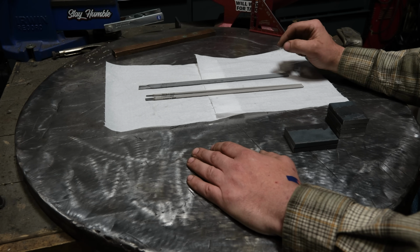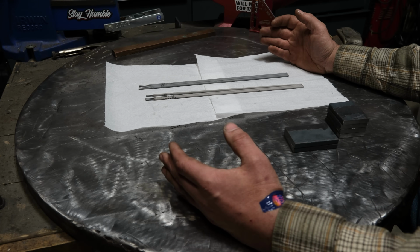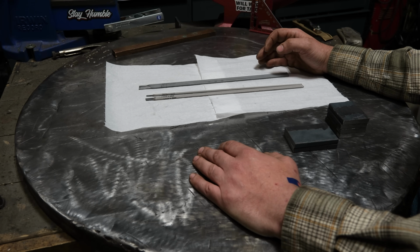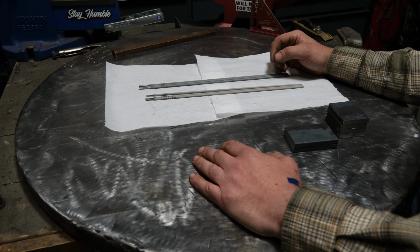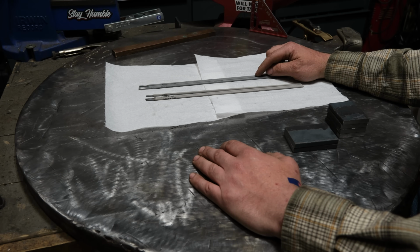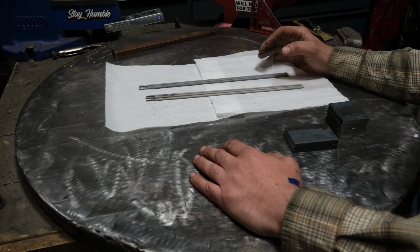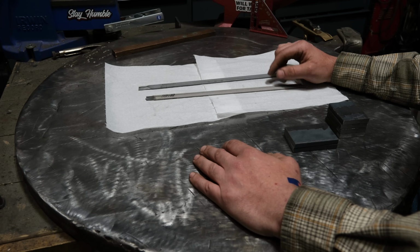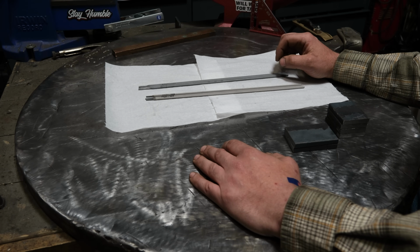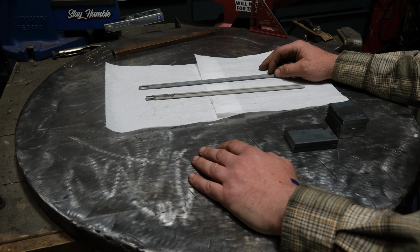That's 6010. Well, 7018 is a tool for a completely different purpose. I mean, yes, they're both welding rods, but 7018 is a much stronger rod in practical uses. However, its weld pool's so liquid that it tends to not fill gaps or holes nearly as well as 6010. It does not have as much penetration as 6010. And because the weld pool doesn't freeze as fast as 6010, the 7018 tends to be a little bit harder to weld uphill for most people. I mean, well, I guess that really depends on your skill level.